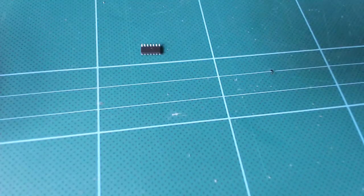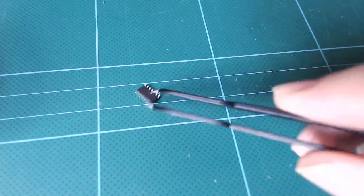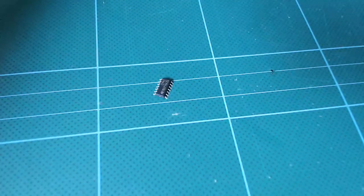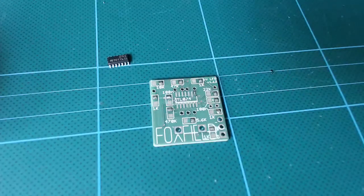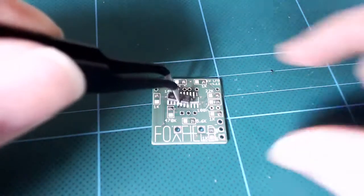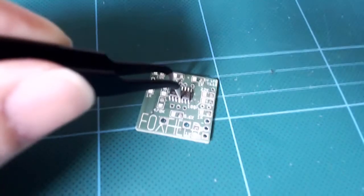You have to attach the IC the correct way around, and the way to tell which way that is on an SOIC chip like this is that one long edge of the IC is slanted, the other is completely right-angled. And if you're not sure which one you're looking at is the slanted one, trust me, the non-slanted one is very square and the slant is very pronounced. So that slanted edge corresponds to the thick white bar on our PCB outline. Here's the basis of how we attach a component.